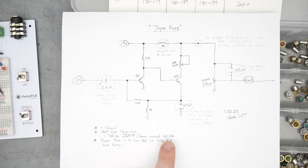Let's see what else. All right, I don't see any more Japanese transistors in here, unfortunately, so we'll just go with this RCA. At least we'll test this. This is a 2N217. RCA 2N217. Throw this in the tester. I've tested with different devices in this bin, so sometimes the gains are off by a bin or two. Yeah, this is 120. Let's see if we can move this over to the right bin. Let's see if we can find one a little bit lower.